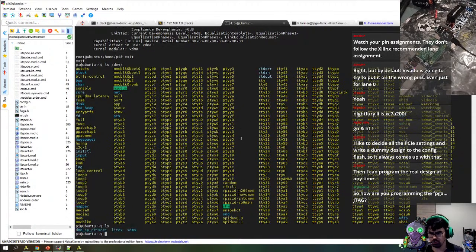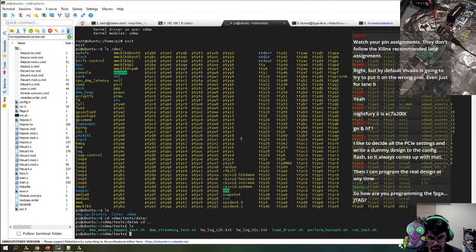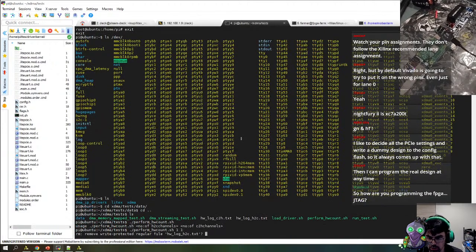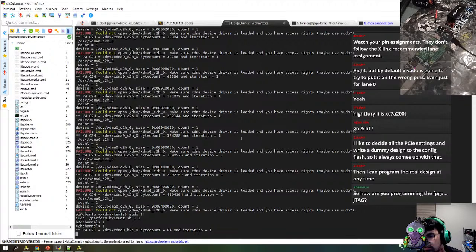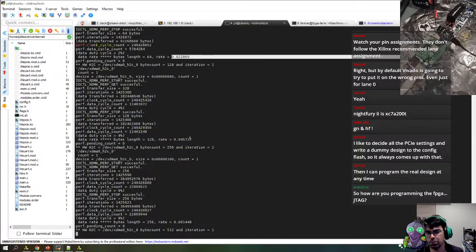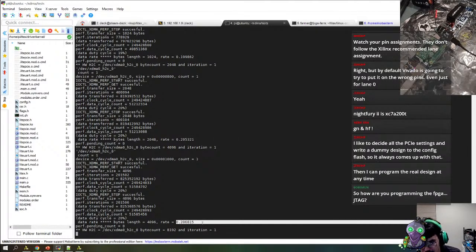Okay, so let's go do a performance test. So we're gonna go to XDMA. So there should be a performance hardware count. So this is a good one. And we're just gonna do one channel each. Not open. Okay. Sudo bang bang that. Okay, so we see the bit rate right here. So this, as I assume, is the megabit rate, or the gigabit rate. We're about at 200 megabits.